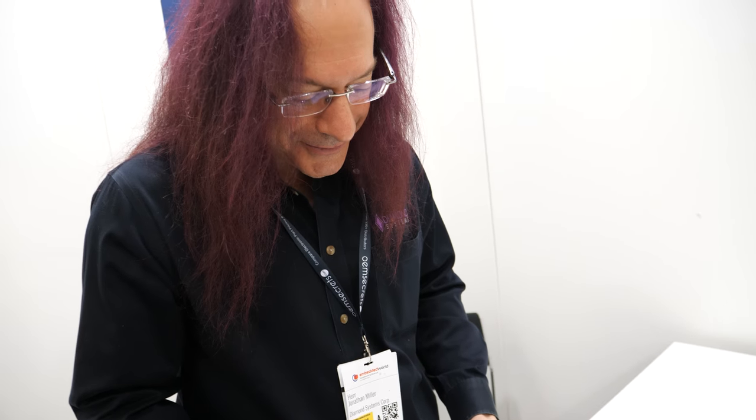We've solved the cable problem. We also have built-in expansion connectors — all the I/O on the standard x86 board comes out through three connectors. If you want to add more I/O using the two mini cards, PCIe x1, or a four-socket expansion, all of those can be cabled out to connectors on the back panel. The case and connector design remains exactly the same, so no custom design is required. We eliminate custom design, which eliminates NRE charges, reduces time to market, and provides a more rugged, compact product. The customer buys the platform, writes their own application, adds whatever additional I/O they need — radio, sensors, military bus interface — and it's all ready to go: plug the board in, cable out, you're done. Great for quick-turn customized solutions with no NRE charges.